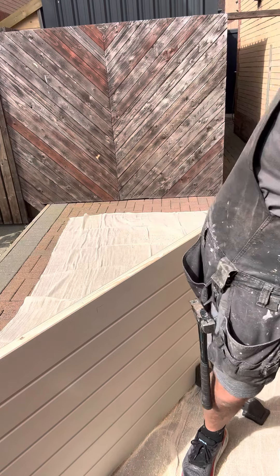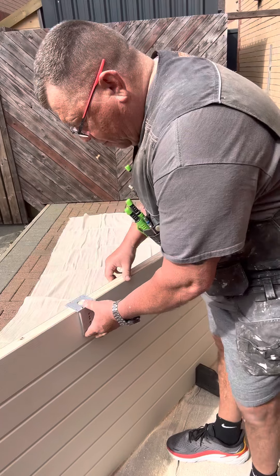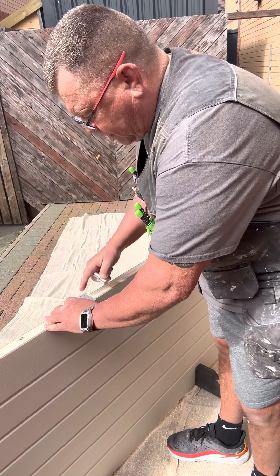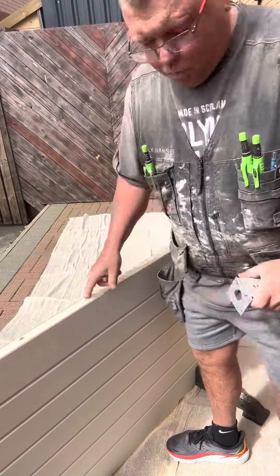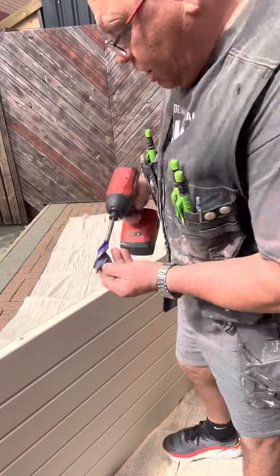This is very simple. You take your latch jig and all you do is centre it. There are centre lines at 12 o'clock, 6, and vice versa. All you do is put your 25mm peg in there and that gives you a mark where to put your cutter.